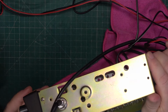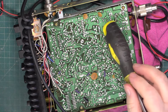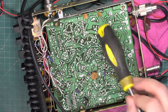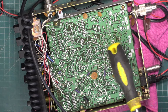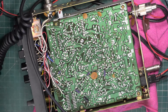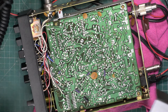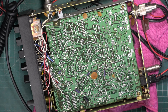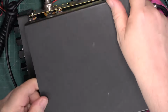Let's go back to PA. Testing 1-2, testing 1-2, testing 1-2, and you can see I do have a vibrator, I have had that on it as well, but there's no problem at all. But we will monitor it, as I say, to make sure that cleaning those two things, the PA switch and the mic gain control, is all that was up with it.